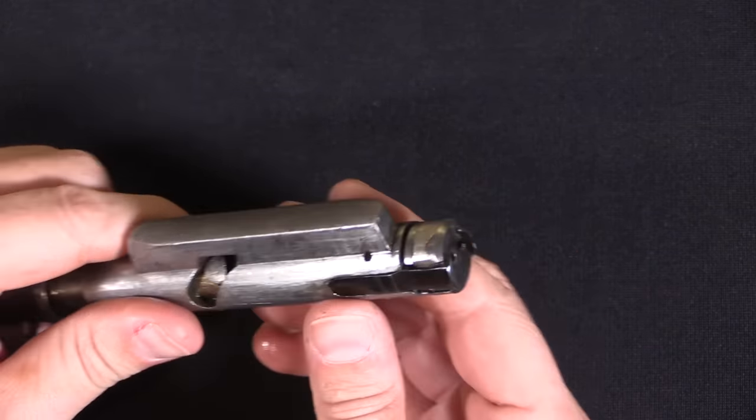There are a bunch of reasons why this didn't eventually see any military service, adoption, or commercial adoption. All the systems that involve moving the primer, moving the case, or stretching the case in the chamber are all not really great ideas — far inferior to the ideas that would take over, things like gas and recoil operation. It would be way too dependent on really good quality ammunition made to exactly the right specification, with a lot of potential for burst cases should the system go wrong. It's really cool to get a chance to look at a rifle like this — these are a fascinating look at the ideas of the 1920s, before people really knew how to do a self-loading rifle in a high-pressure cartridge like .30-06. A big thanks to Legacy Collectibles for giving me access to film this. Thanks for watching.